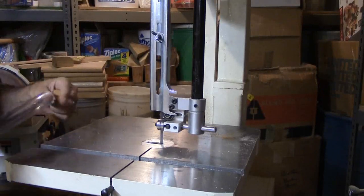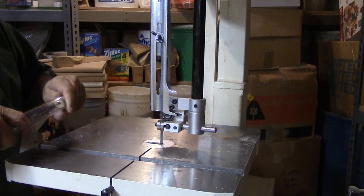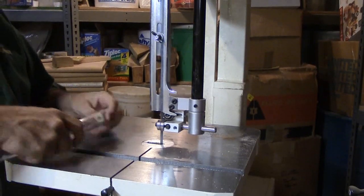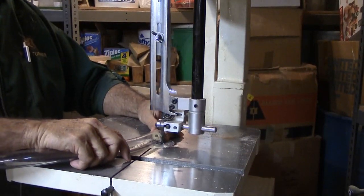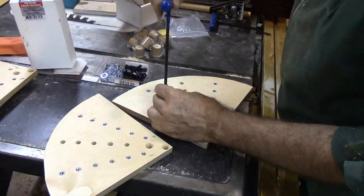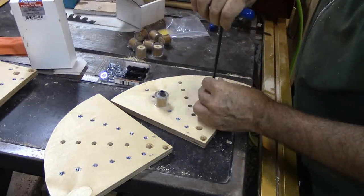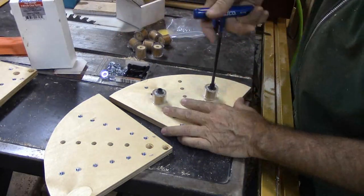Next time, I may try to first jam on as much vinyl onto a dowel as possible, chop it to length on a chop saw, then drill the center hole on the lathe. We'll see. After mounting the posts, it's ready to use. Be sure to run at a lower speed. These jaws are wood, not metal, so be safe.